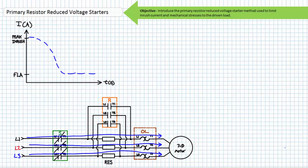When the S or start contactor closes, the current drawn by the motor must travel through the primary resistors. Ohm's law states that there will be a voltage drop across the primary resistors proportional to the current and resistance. This means that of the total applied voltage, the primary resistors will drop a portion and the motor the remaining portion. Kirchhoff's voltage law remains in effect at all times.